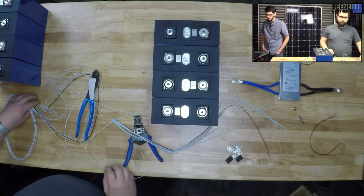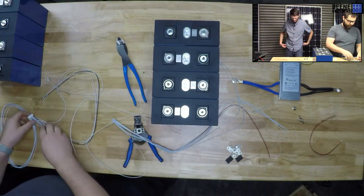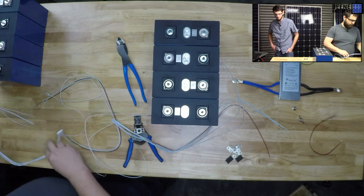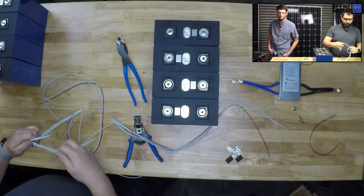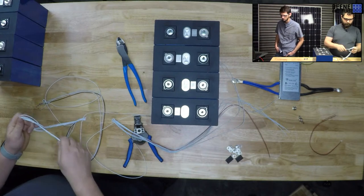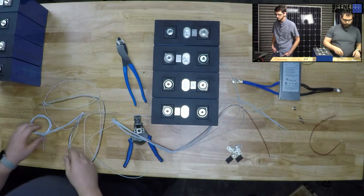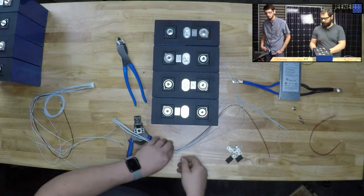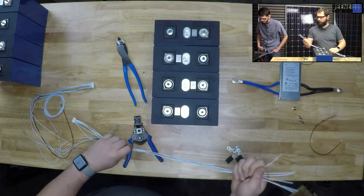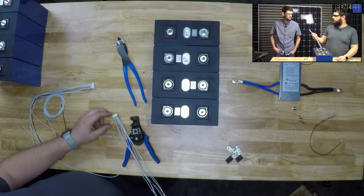In which case, yes, if you can do your stuff to do a 48 volt, like I did a small solar generator. And I ran that thing on like a 10 gauge wire, but it had a 1500 watt inverter, and I could do 60 amp charging. Could do like 2.8 kilowatts worth of panels all on 48 volt. And for something that you could pull around in a suitcase, other than the solar panels, of course, 48 volt was nice because I didn't have to have any of those big 2 gauge or 2 aught wires to handle that amperage.